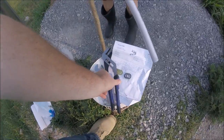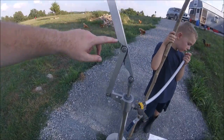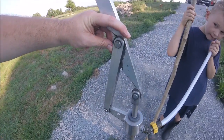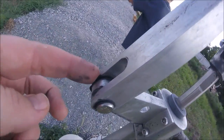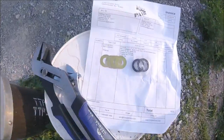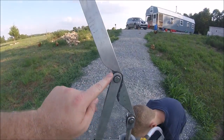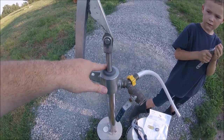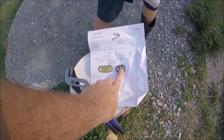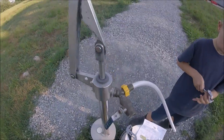After talking to them — and they were awesome — they sent us some new seals and also some brass shims that go in between the joints, because I told them our brass shims were getting really worn out from heavy use. See how that one's flattened out like a pancake — thin and crispy? Here are some brand new ones that aren't thin like paper. So we're going to replace these brass shims, which are basically like O-rings. We're also going to remove this assembly right here to change the seals, which are similar to a hydraulic U-cup seal.